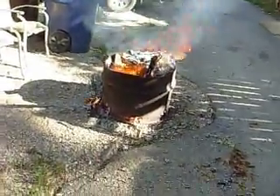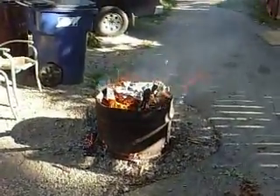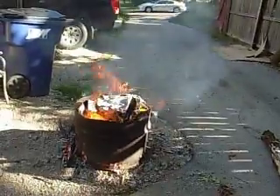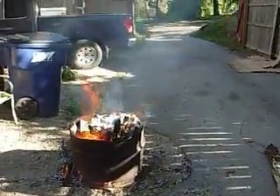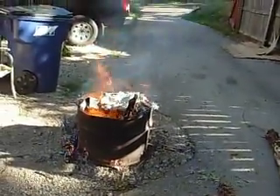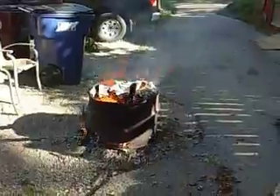It's almost a hundred degrees today. The whole bottom is filled with glowing ash and most likely glowing files. I'll be letting this burn all night long, and then probably until Tuesday — today's Sunday. I will be taking the files out once everything is cooled naturally. You get it real hot, let it burn, then leave it in there and let it cool slow — that takes the temper out of the metal.